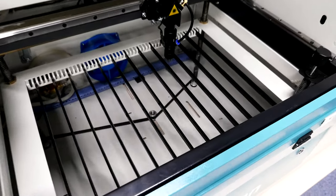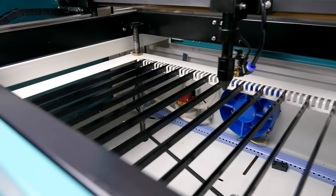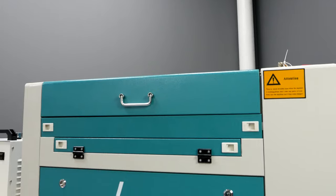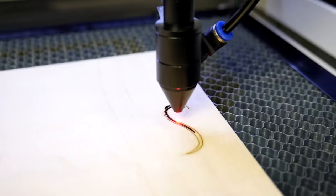The work table is equipped with anodized blades. The anodic treatment is done to avoid backfiring of the laser beam to the material or the machine operator. If blades are painted, soot and carbon deposit will be created on the downside of the item when cutting plywood. In addition, a complete set includes a honeycomb table, which is used for cutting small details or items.